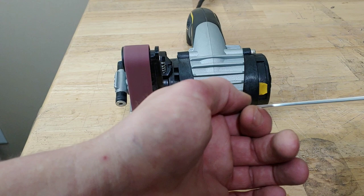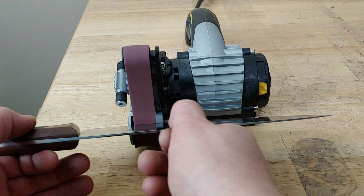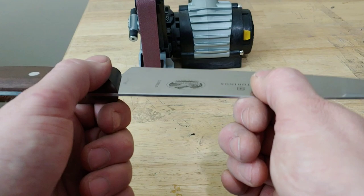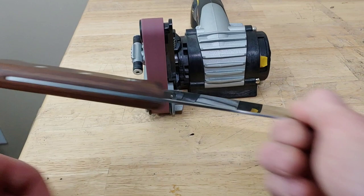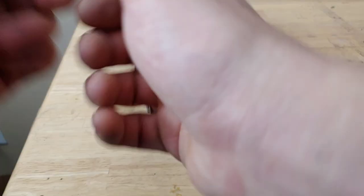You can just set it up where you hold the knife at an angle and run it across the belt. If you look at my hands, I'm actually using my hands as a guide — I'm taking my four fingers underneath the knife and keeping them the same. They're basically rubbing across a flat surface, which is the table. I'm holding them right here and putting them in the exact same spot every time, using my fingers to run across the table. That way I'm holding it the same way every single time. I've had really good results this way. I do recommend doing one side at a time before you flip.